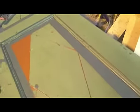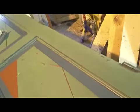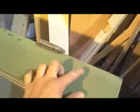This paint, I would have thought, is from around about 1920, maybe a bit later, and it looks to me like it's very handmade. It's just pigment mixed with oil, which is how I make my paint, without very much grinding. I don't usually grind my paint because people didn't used to grind their paint in the past. I just stir it together. I might grind it if I see evidence that they have done before, which they do in fine houses with richer customers.